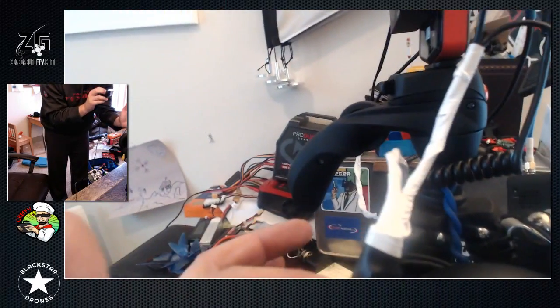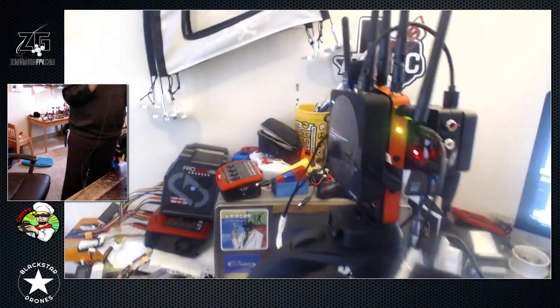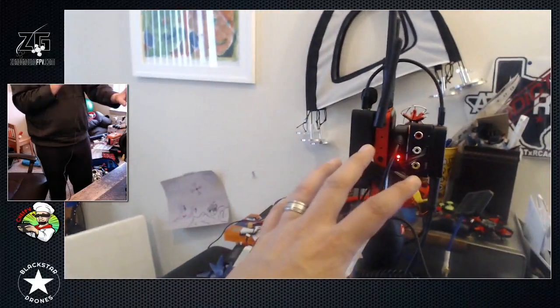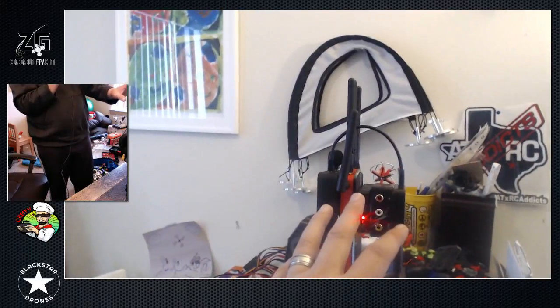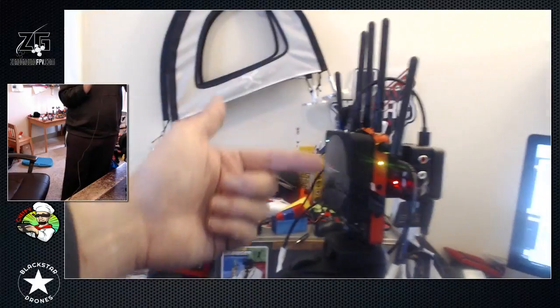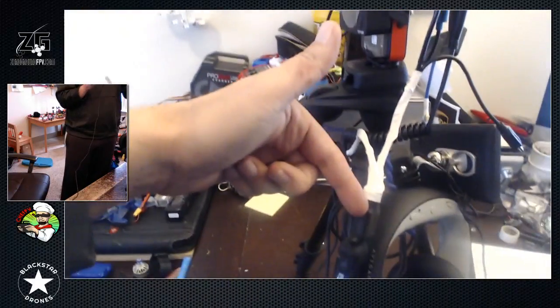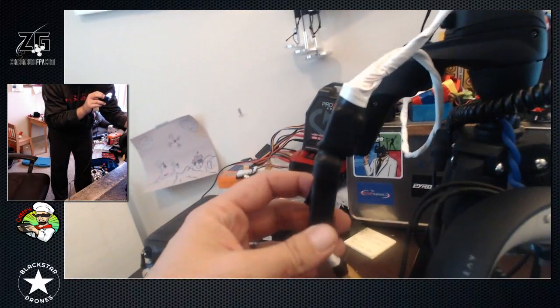And then we have a second one that I'm powering the cloner box by itself off of, because I was afraid that, even though these step downs pull 3 amps, I didn't know 100% how much all of this could pull at its peak. So I wanted the 3.3 system isolated, and I wanted the digital system isolated on its own 16 volt or 12 volt power. And then off this other step down, I ran 5 volts, 3 amps straight to the box. So all of that is wired directly into the back of this switch that I got.